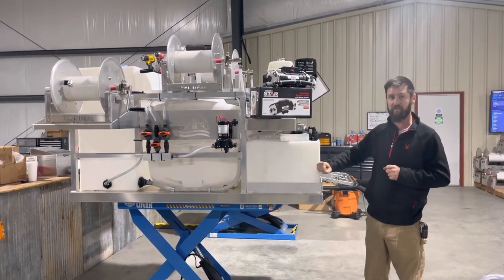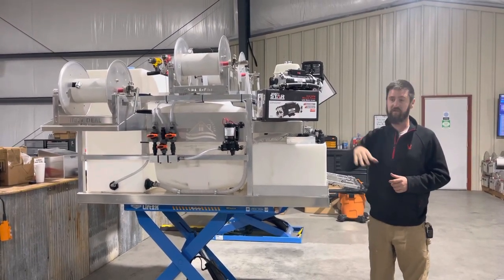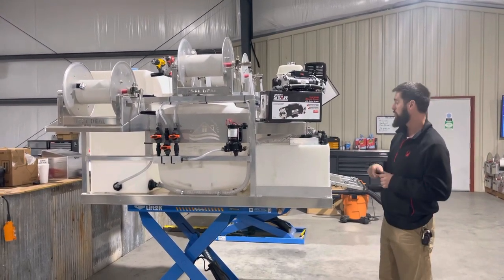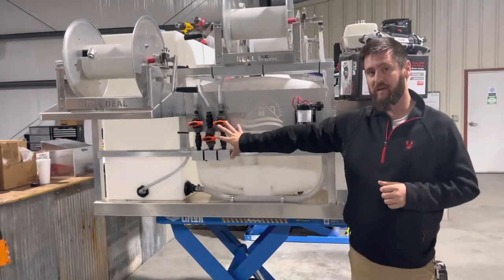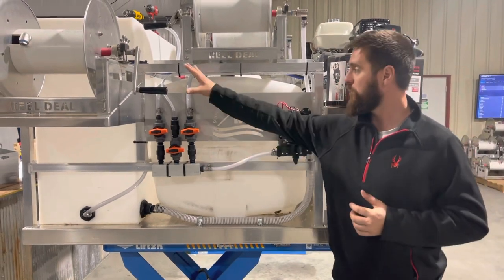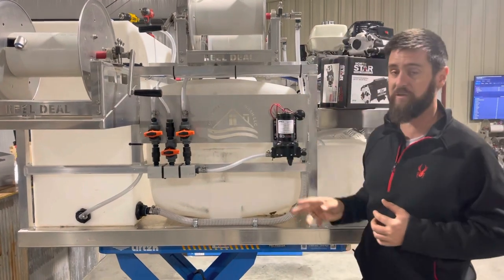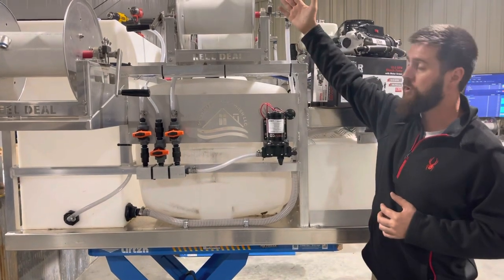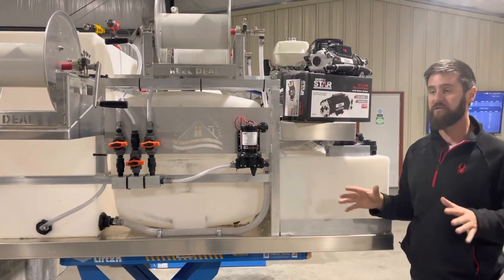If you've got one of our systems — whether it's a Lumimax, an older dual blend skid, one of our trailers — you're not going to have to change a whole lot, but you're going to have to change a few things. If we look right here at this standard half inch manifold, this is what you need for a 12 volt, five gallon a minute setup. We've got half inch plumbing on the suction side, half inch bleach line, half inch water line, quarter inch on the surfactant. Everything here is plumbed on a half inch and runs out to the hose reel half inch all the way out.